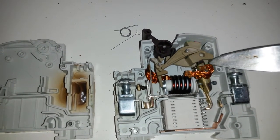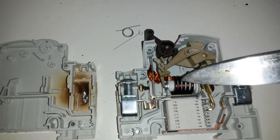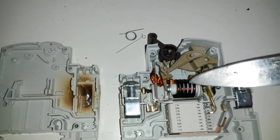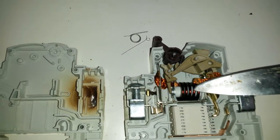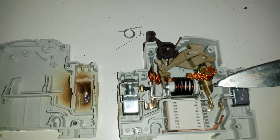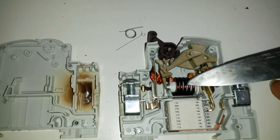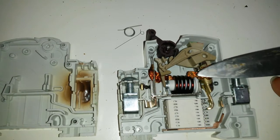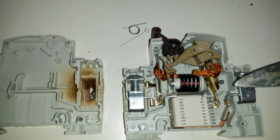That contact, there's a pigtail, resistance welded, goes into an inductive coil and comes back out, comes down here and joins to the output. Essentially, once you have high enough current, the force created by this inductor, essentially a solenoid, will pull this pin, disconnect that, break the circuit. So that makes sense. That's your instantaneous trip. And depending on how many coils, how this is set up, you'll get the force configuration correct to be able to disconnect. That makes quite a bit of sense.